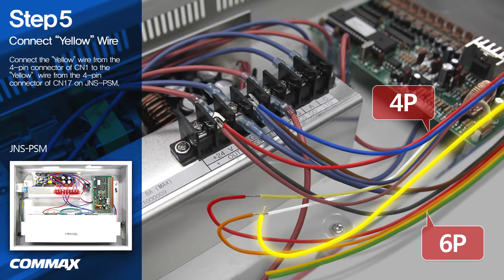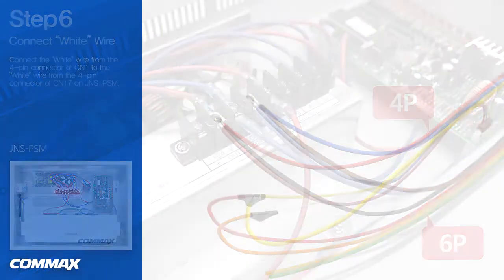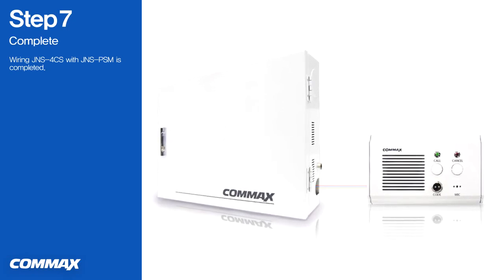Please connect the yellow wire from the 4-pin connector of CN1 to the yellow wire from the 4-pin connector of CN17 on JNS PSM. Please connect the white wire from the 4-pin connector of CN1 to the white wire from the 4-pin connector of CN17 on JNS PSM. Wiring a bed console JNS 4CS with the main panel JNS PSM is completed as shown in the above.